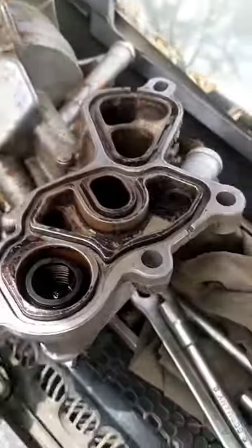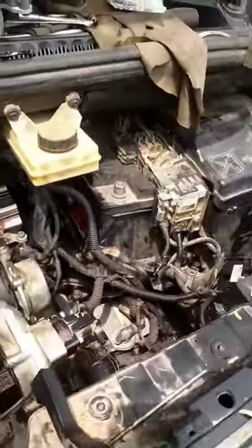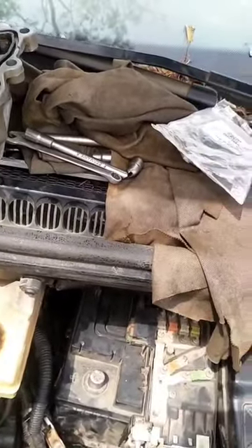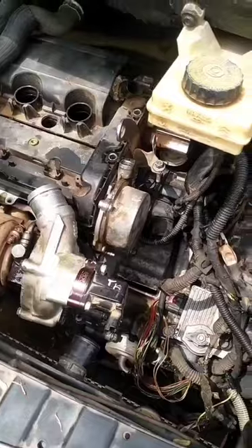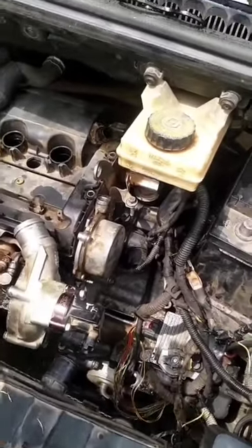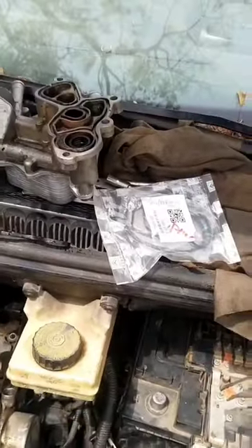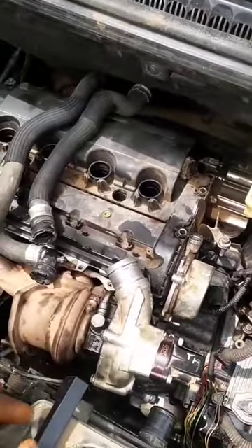The seal is here, so I'm going to mark the seal here so that you know we eliminated — or rather, ruled out — all the seals and gaskets that can cause this mixture. Because I know it's there. Any gaskets or components that can cause the mixture of coolant and engine oil or transmission oil have all been replaced. Even the head gasket was replaced. Like I said, it wasn't the gasket that caused it, but we had to change it because eventually the mixture blocked the radiator, caused overheating, and then the head gasket failed.